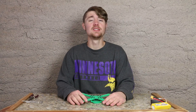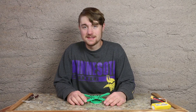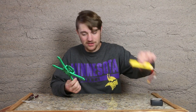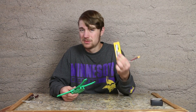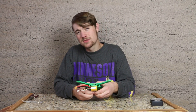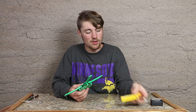Alrighty, so I went to start installing the electronics and slowly realized that we're gonna need some extra components to 3D print first. The first being some sort of stand for the quadcopter. I made a mistake of just thinking that I would mount the lithium battery on the bottom of the quadcopter and that would just be the stand. The problem with that is LiPo batteries are explosive if punctured, so protection of this thing might be a little important. I'm gonna end up printing some sort of stand that will help hold the quadcopter up as well as protect the LiPo battery.